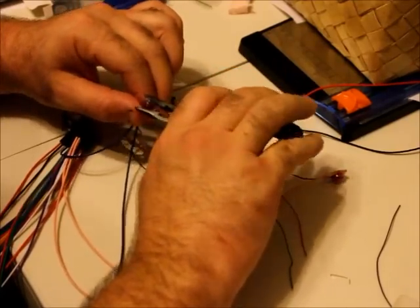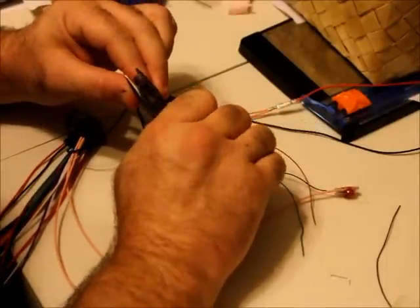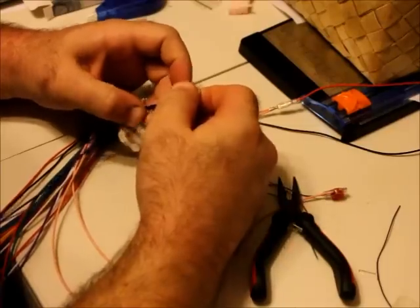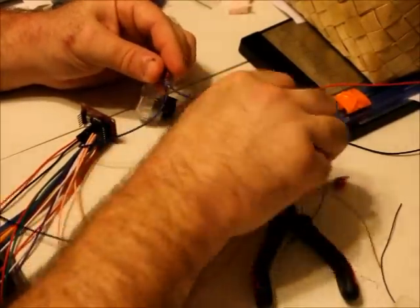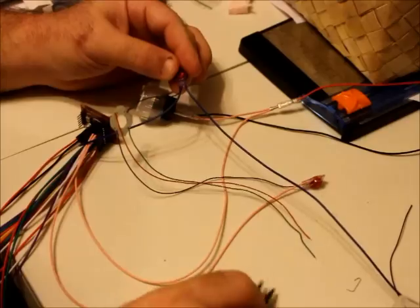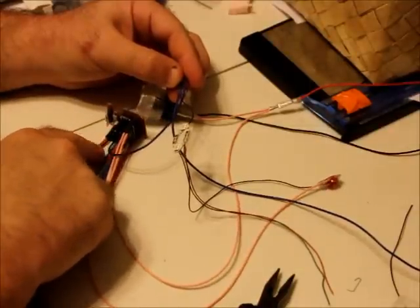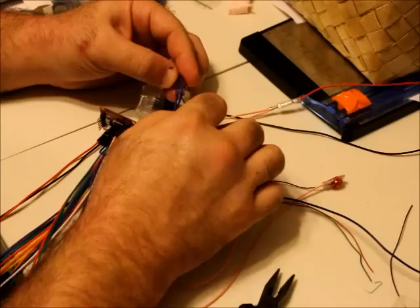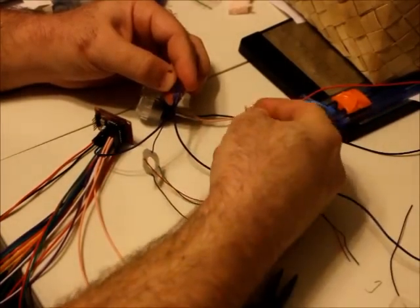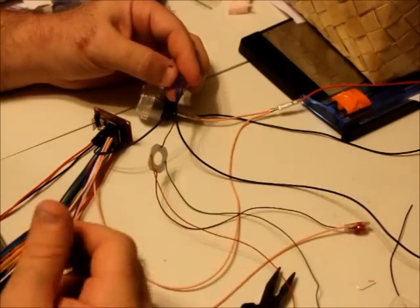There's a silicone gel inside of these that protects them — not sure that's really important inside the joysticks unless you're playing with your joystick underwater, but you'll see that squeeze out a little bit. You can tug on the wires to make sure they're in there nice and tight and nothing's coming out. Now we have blue connected. If you're going to hook the next button up, you would just take this over to the next button and repeat this procedure. Starting at the Sparky, you have the blue coming off the Sparky going to the first connector. You've tied the Wheeler into that first connector, and then you have a continuation of the blue going onward. You can just keep doing this over and over by adding more — you do it for blue, red, and green. That's the basic connection premise.